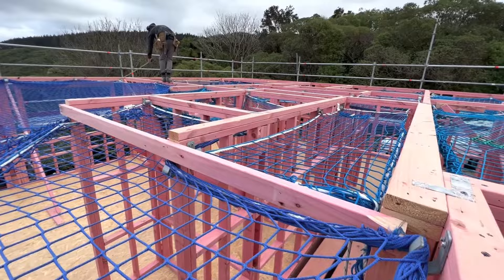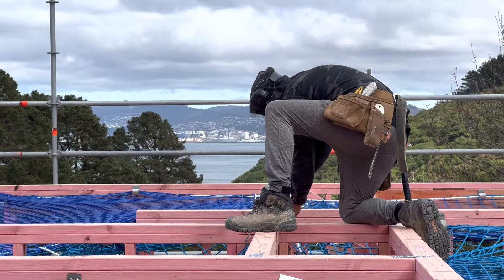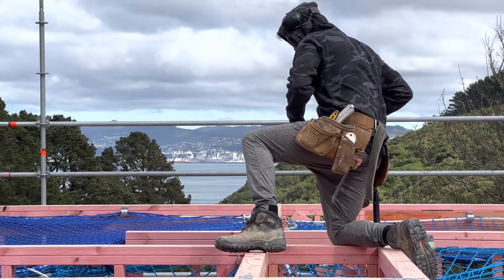You've plumbed all your internal corners and straightened all your outside top plates. Now straighten your inside top plates. Then go around the top and nail plate off all of your joints. Ideally the pre-nailer will have supplied a box with all the fixings, otherwise go to your local merchant and get the nail plate fixings. Double check all your fixings as per the bracing plan — have you allowed for all the GS1s, all the BLs? Double check whether you need stud straps and lintel straps. This is your last thing to do — you have done your frames.